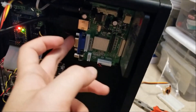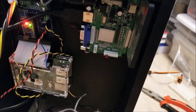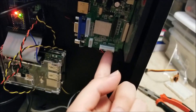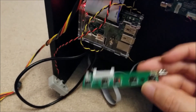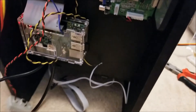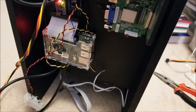If you ever do need to access it to change things — maybe I want to hook this up to an external computer or something like that — I can always do that because I have composite, VGA, as well as HDMI. But you need a way of changing the mode. I could have grabbed the control signal from this ribbon cable, which originally was connected to this little LCD board with the IR sensor. I broke out the IR sensor, but I removed the other wires for the other buttons and the power LED indicator because I thought it wasn't necessary, which really it isn't if you have the remote. So I'm just going to keep the remote there — it's more convenient than drilling extra holes and mounting extra buttons.